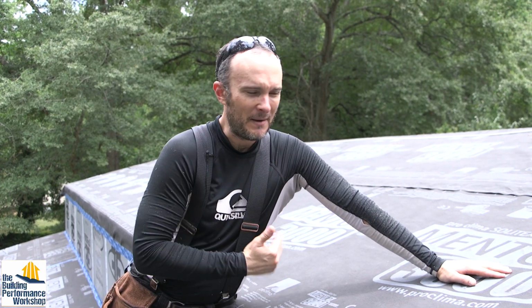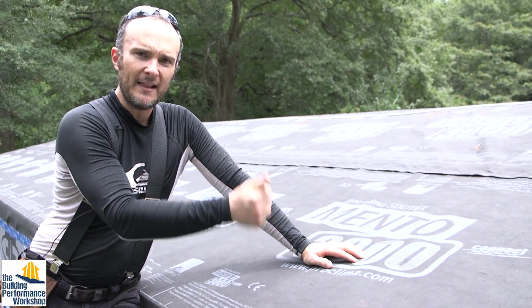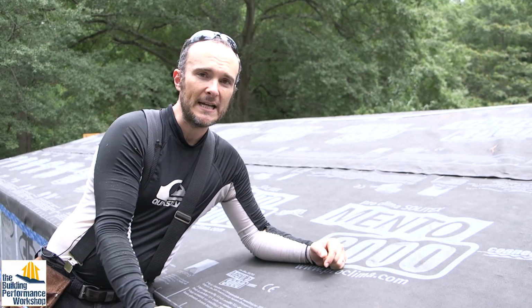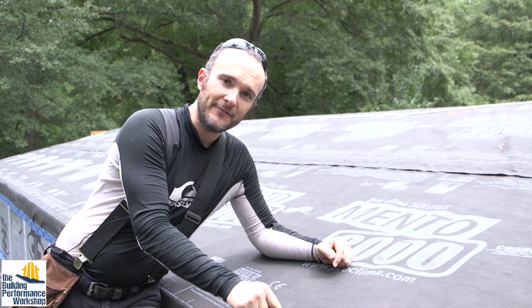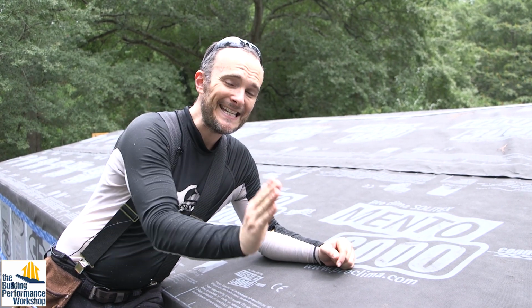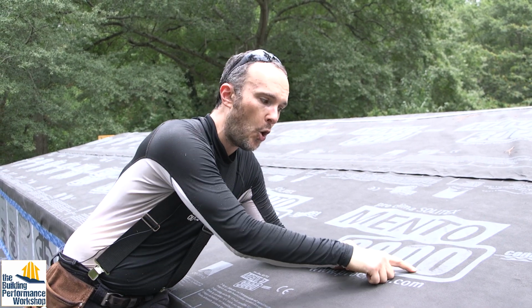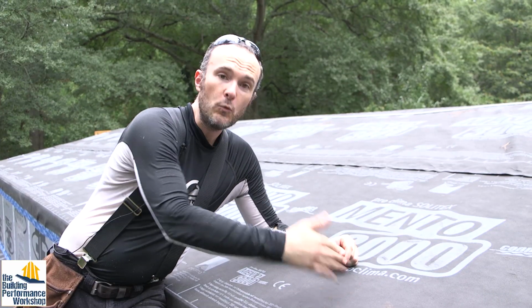It's too good for that, in my opinion. So I want it to be here for 100 years. That being said, these scuffs, where it gets intense or a little nail head or a little piece of plastic pokes up through, you will find that after we're done, once it does rain. I can take a walk under this roof and find all the puddles on the floor, and I will look up, I'll see a seam in the OSB, and above that somewhere, I'll find a little hole, which I can simply fix with a small square of Vana. So I will be coming back along after I'm done beating this up.